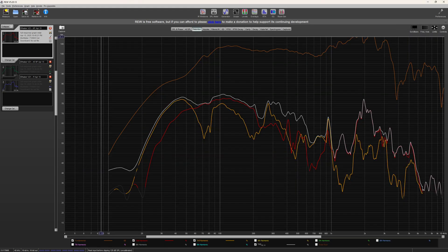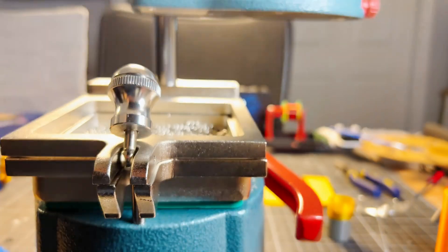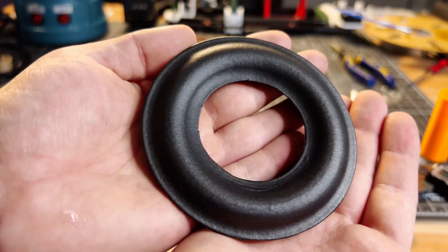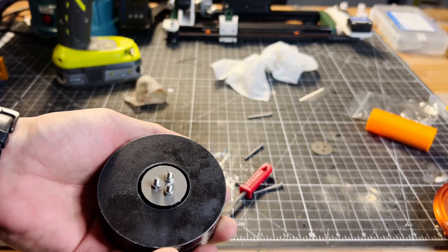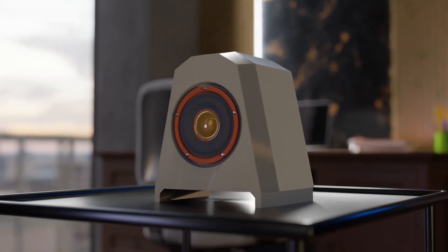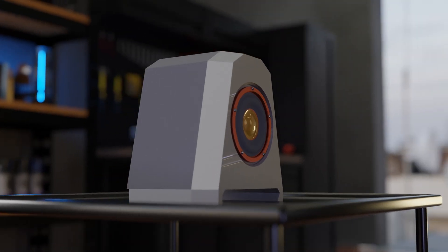From here, we can take a quick look at distortion and move on to the closing statements, so feel free to pause for the distortion. Overall, I'm very pleased with this project as it brought along a ton of information regarding speakers for the future. I can use EVA foam that is vacuum-formed, but I need to be careful as it does not offer much control of damping of the system. I think I may try a pre-built foam surround in a future build. On the topic of damping, I believe the mechanical damping is an area to focus on next time. The electrical damping was within my specs, so I'm quite happy with that. I do have a 3D-printed subwoofer in the works — it will release soon, as that was the requested project on the survey I released a few weeks back. Make sure you're subscribed and click the bell so you know when that subwoofer video releases. If you enjoyed the video, give it a thumbs up, and thanks for watching.